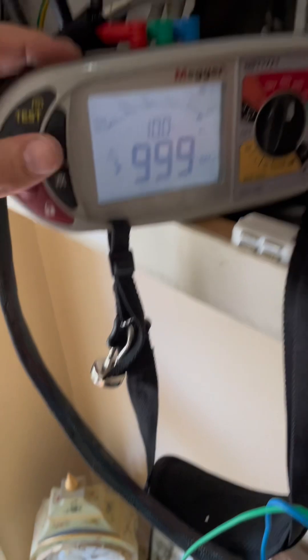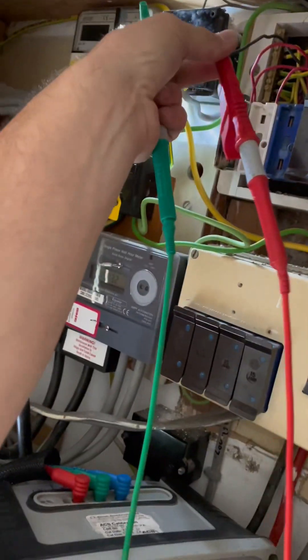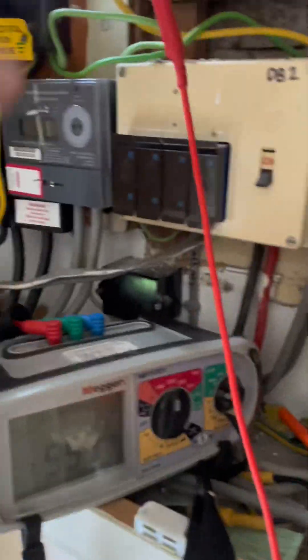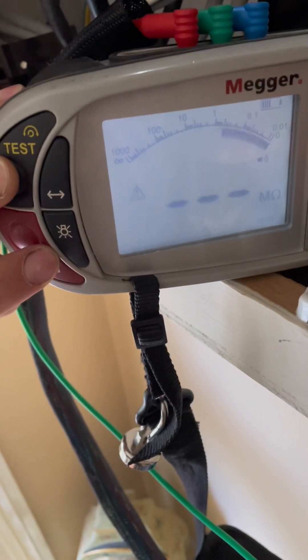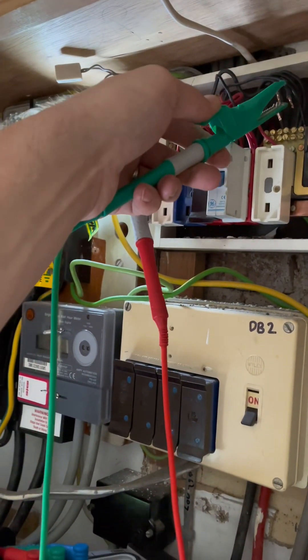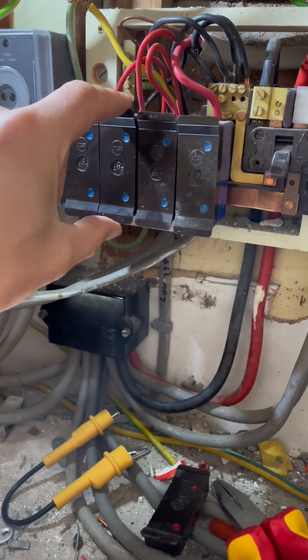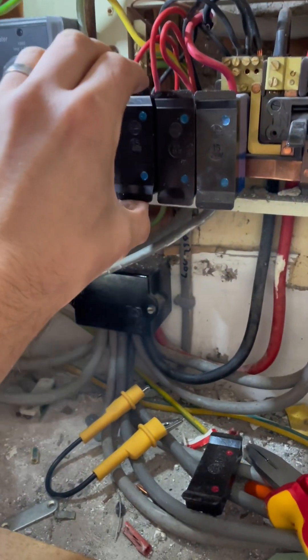I was just about to test this lighting circuit for insulation resistance, but when I put my meter on it, it said 230 volts between neutral and the CPC - even though I had isolated it and pulled the fuse. It goes dead when I turn the downstairs ring final socket circuit off - that's f**king strange. Insulation resistance between the downstairs lighting neutral and the ring final - to the neutral bar it's clear, but if I go to the neutral of the ring final, dead short. There is something going on there. Turns out someone had f**ked the RCD spur - just banging it in some Wagos.